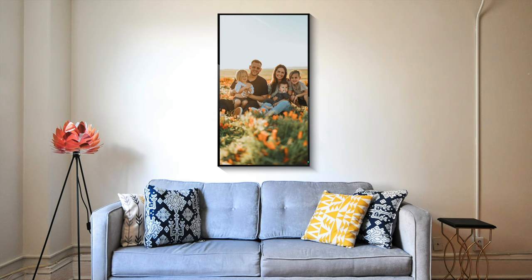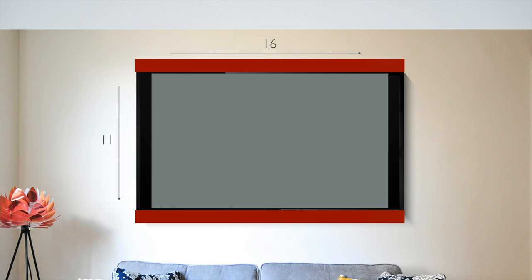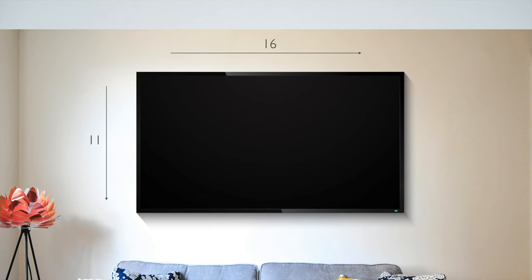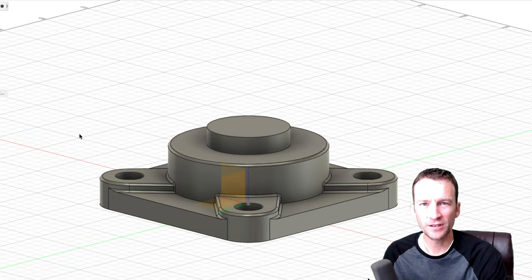The problem is that when you display photos in landscape orientation it looks great, but when a portrait photo comes up it shrinks down and you get awful black bars on the sides. The solution is to rotate the entire display so portrait photos appear full screen. TV displays are 16:9, but most cameras shoot around 16:11, so I handle the difference by scaling the image up and cropping the top and bottom to fit the screen.